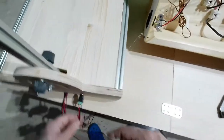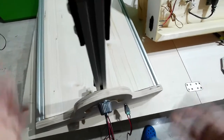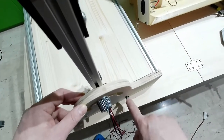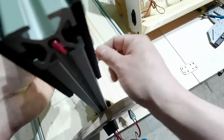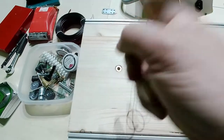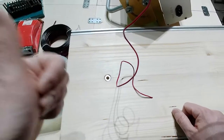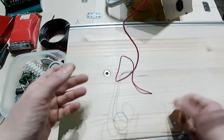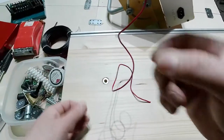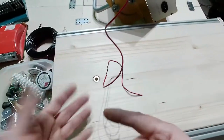Let me explain. If I use 220 volts in my case, or 120 or 110 or whatever you have in your country, it will be too high. If I connect the power connector directly to the plus and minus, to both sides of this wire, so the power is directly connected to the nichrome wire that will be there, first, it will make the nichrome wire red incandescent, and then it will break in just a few seconds, maybe just 1 second, because it is too thin. The nichrome wire is too thin to support as much voltage as I'm bringing.